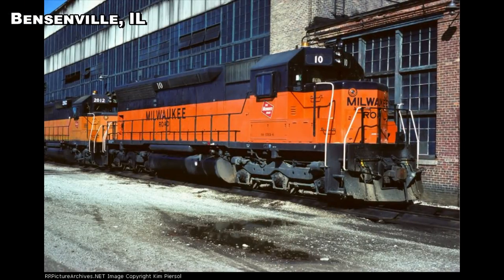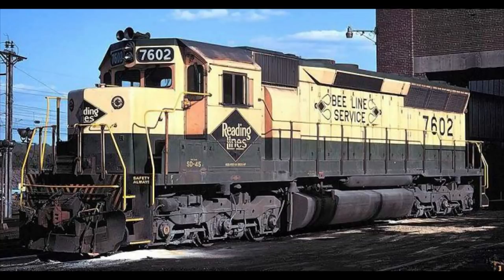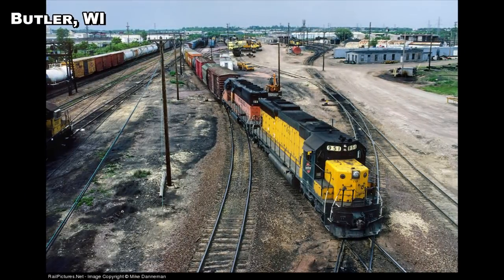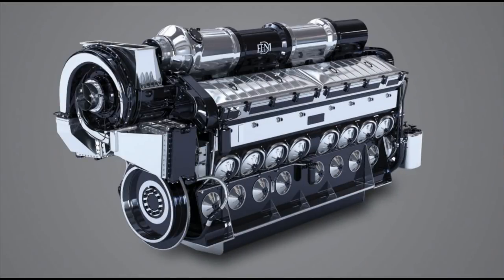The 645 series engines have a maximum engine speed between 900 and 950 revolutions per minute, an increase over the 800 to 900 RPMs of the 567 series. When in motion, the engine speed varies depending on the throttle position. The 950 RPM speed of the 645F engine was too high and compromised its reliability, and as a result, it doomed the 50 series locomotives, as we talked about in video T-146. A link to that video is in the description, just in case you missed it. Because of that, the replacement engine, the 710G, reverted back to the 900 RPM maximum speed.